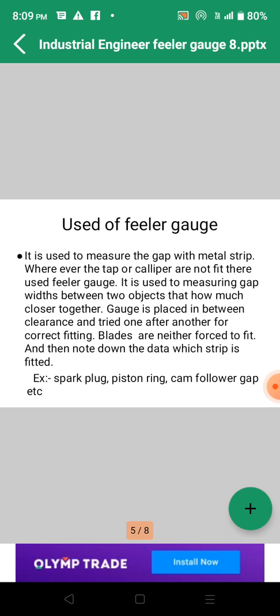After it fits, we will not use force to fit the clearance of that gap, right? If the gap is forcefully fitted, then this value will become an error, or the data of the strip which we have selected will become an error. So for the clearance gap of the spark plug or the piston ring, the strip that fits freely is the one whose data we can use, right? I hope you guys understand much more about the feeler gauge today. If you do not understand, please comment below.